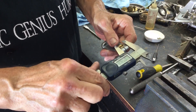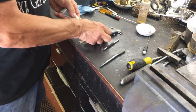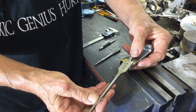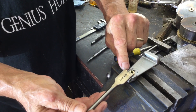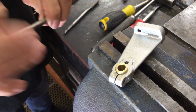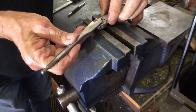So we got our vernier calipers out. It's about half an inch, but we don't want to go half an inch. We don't want to go three quarters either, because when you see this Morris wood drill, look here — you see how far over these edges are to the bearing. That puts pressure on the outside of the casting and not the bearing. So what we're going to do, because I measured it, I'm going to go to five eighths.